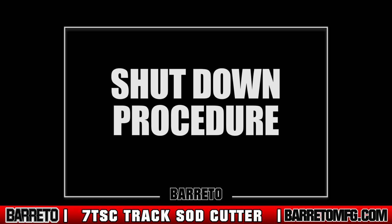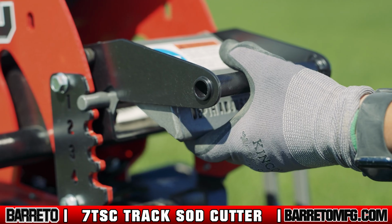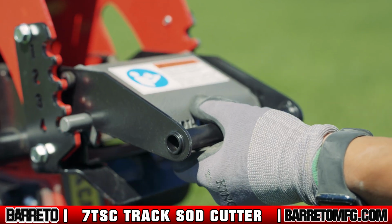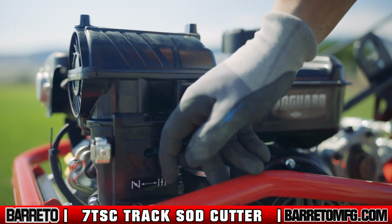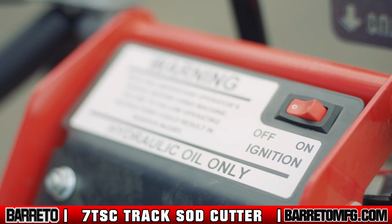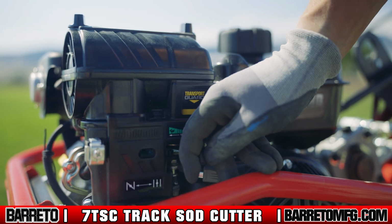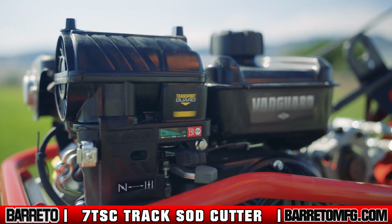Shutdown procedure. Always leave the sod cutter parked on a level surface. Unless the sod cutter is parked on a trailer, lower the cutter blade to the ground. Reduce the throttle lever to idle, and then either move the ignition switch to the off position or continue pushing the throttle lever to the stop position. Both will shut off the engine.